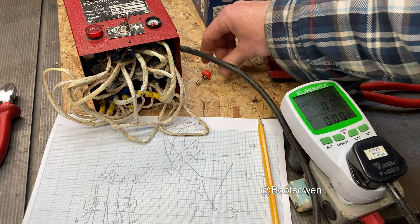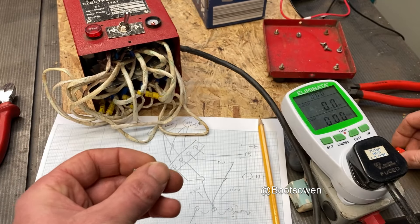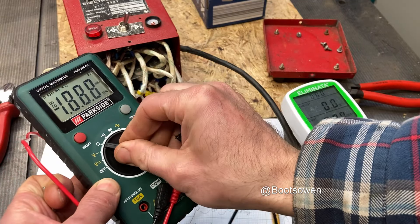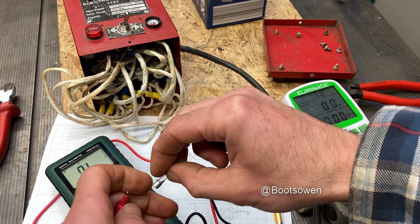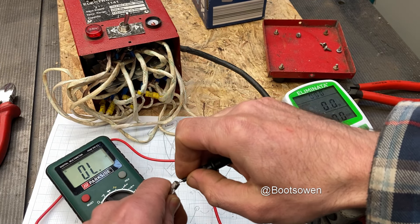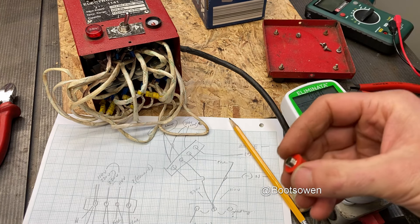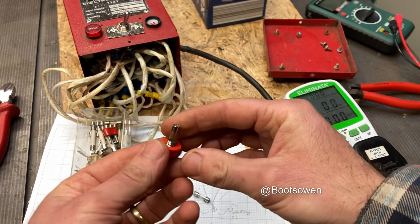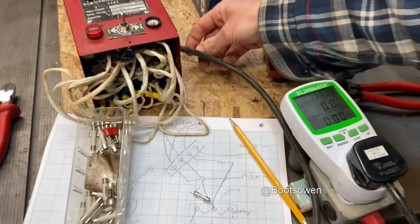I'm not seeing any action out of that. Let me test this first - I should hear a beep if there's continuity, although I don't see why it would if they'd wrapped it in tinfoil. No. So before with the fuse out and switched to 110 volts it was coming on. Let me see if I have a similar fuse - I think this is a 2 amp fuse. Let's turn it off first - I'll know pretty quick if it flashes.